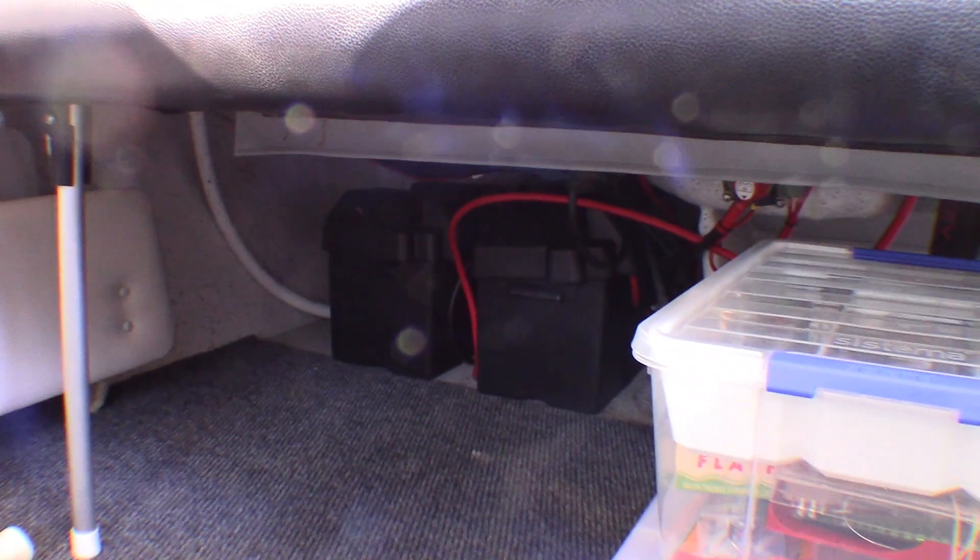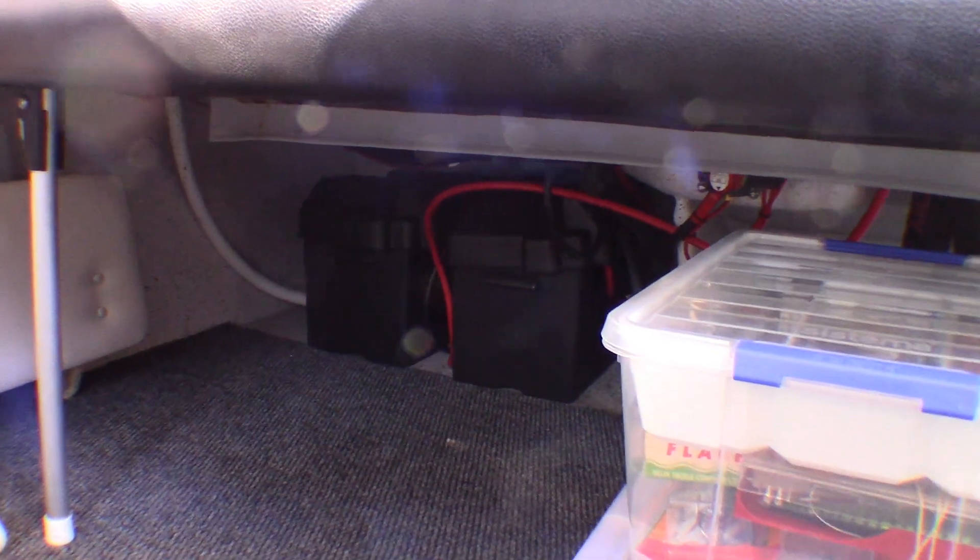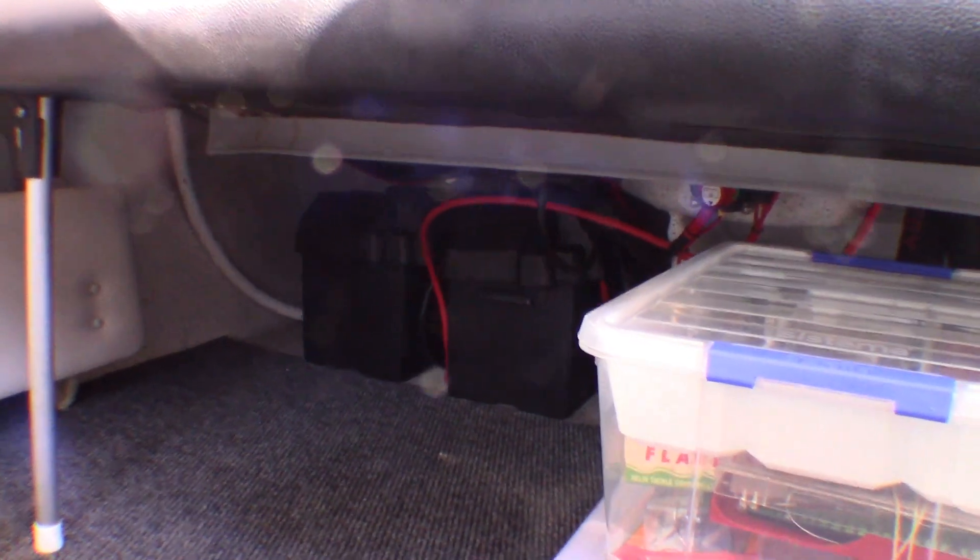So that side of the boat I've got in there is a 12 volt system — will eventually be a dedicated engine battery and a dedicated house battery, with the ability to swap them over in case I need to start the engine and the engine battery is flat.